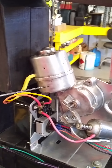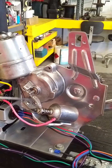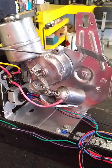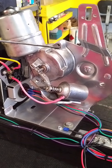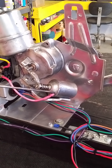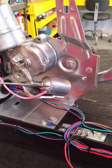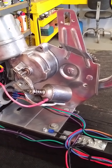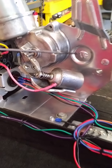This is your drive motor. This is your clutch housing assembly. This is your solenoid, which engages this two-stage clutch. Within this clutch assembly, there is a two-stage clutch which has two clutch discs — one to raise it, and one to engage to hold it when it's in position. This solenoid, which engages and disengages the clutch drive, is not actually the original solenoid for this part. When it came to us, it was really out of whack, so we had to do some modifications and some extension to get the angling and everything right on it. This is your lift arm here.